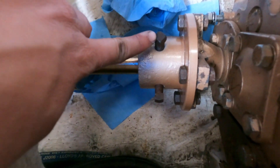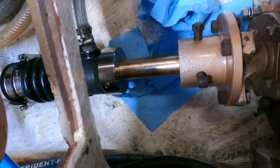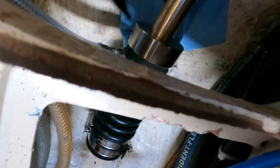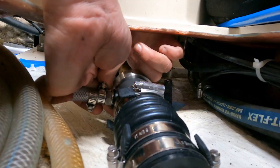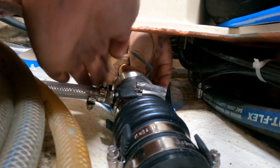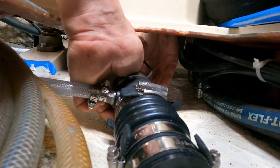I'm going to run some wire between the set screws to make sure they don't come loose, and I'll tighten everything up and set the rotor. I marked where the rotor sat against the carbon graphite flange on the shaft to use as a reference point, then compressed the bellow three-quarters of an inch past that point and used the set screws to lock that in place.